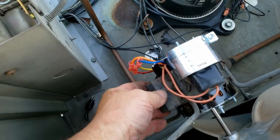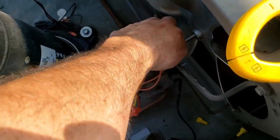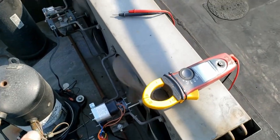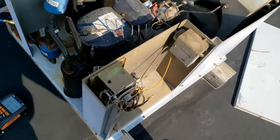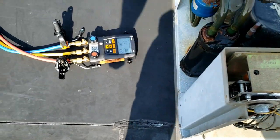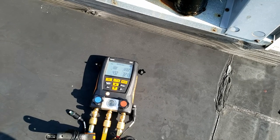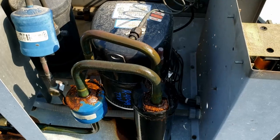There we go — it should give it room to breathe. The amp draw is usually right at about the maximum but it works out fine every time. Get these nuts off. That kicks on a little better. There's a little bit of a wobble — you can tell there's a speed difference there. Let's jump back over to the other unit and make sure it can still pump down. It's at 31 so it's starting to drop, obviously. Let's make sure this thing can pump down before I head downstairs. Of course I've still got to clean that condenser. Head pressure's going up a little bit but it'll do a lot better once we get that condenser cleaned. It's starting to go back down so we should be fine. Those bearings in that compressor sound funny.